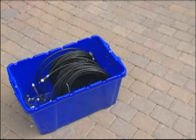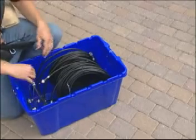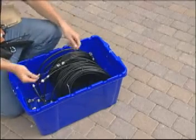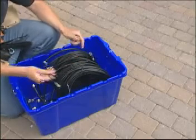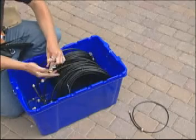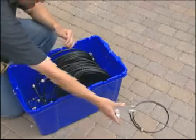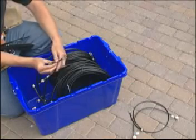Nokia recommends two types of RF cabling for wireless router and antenna installations. The first is a flexible standard loss jumper cable, also known as a pigtail. They are short, usually less than 5 feet. They are flexible cables that connect amplifier components with the antenna and wireless router, or are used to connect the low-loss RF cable to the wireless router.